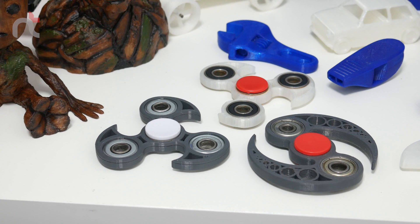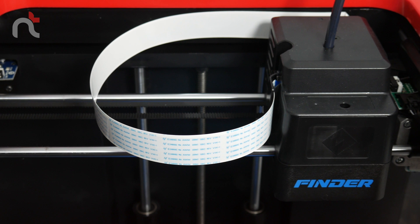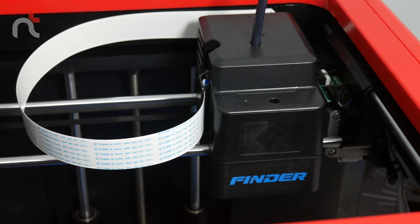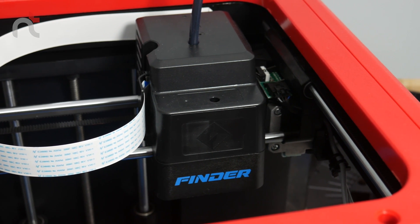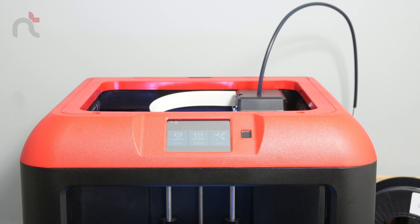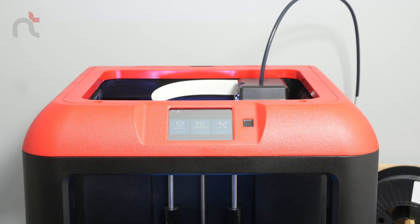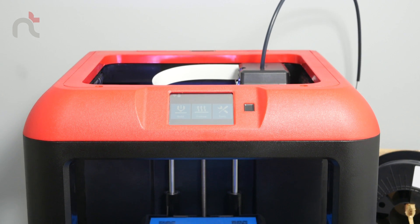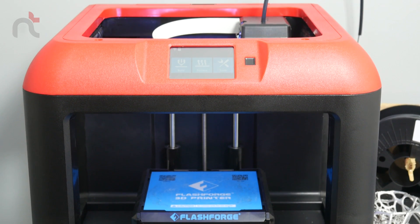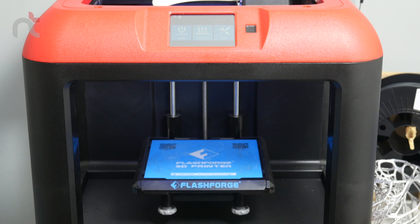Since I've had it, I've had one occasion where the extruder was jammed. All you have to do is open a couple of screws from the extruder head, and then there's a little needle tool that you push in once the extruder is hot, and you can just unjam it. It's very simple, and there are a ton of videos on how to do it as well. That was the only small problem I had — otherwise this printer has been fantastic.